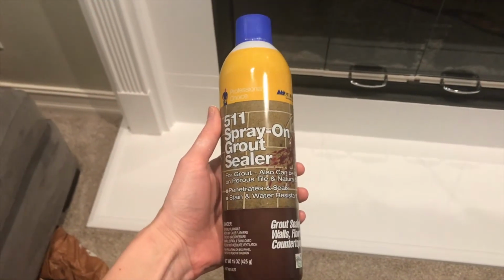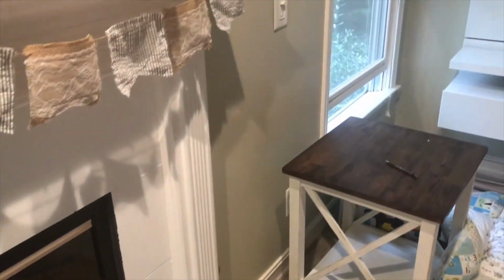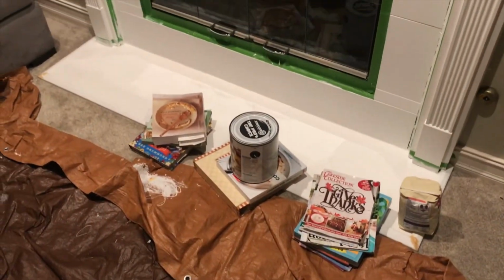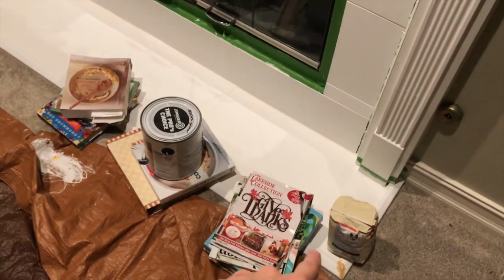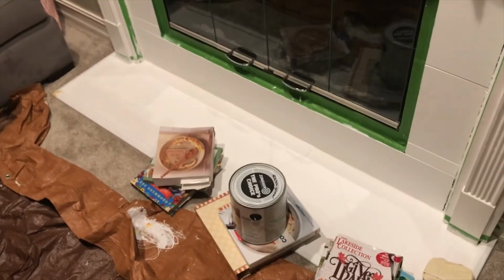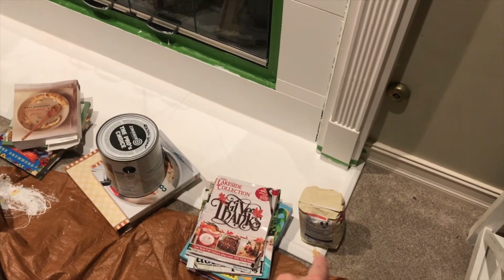Okay, so last night while the kids were sleeping, I applied the spray-on grout sealer to this crease right here, had the windows open, fan running, and I let it dry overnight. You may recall I had 2 broken pieces of trim on the floor tile in front. I painted those white and I re-secured them back to the marble with some liquid nails on the back, and then I nailed the corners of the wood together with some basic wood nails and wood glue, and then wood filler in the corner, sanded it, let it dry overnight, and then everything was much more secure and more seamless.